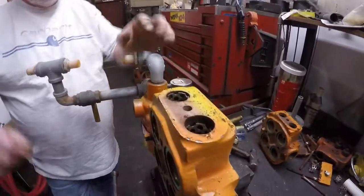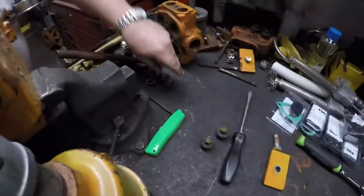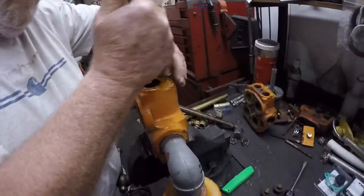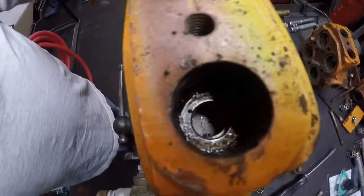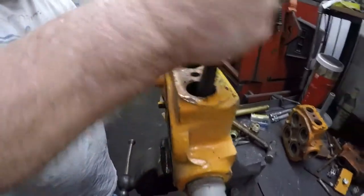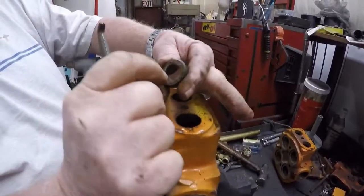At this point we're going to go ahead and remove the valve cages. You can just use your fingers and wiggle them, or there's a valve puller tool on the table — you can use that to grab the edge and pull the cages out. We removed our two valve cages. Now if you look down in, the valve seats are still down in there. We're going to use that same valve puller tool, flipped over to use the other end, to wiggle the valve seat loose, then flip it back and use the hooked end to pull the valve seats out completely.